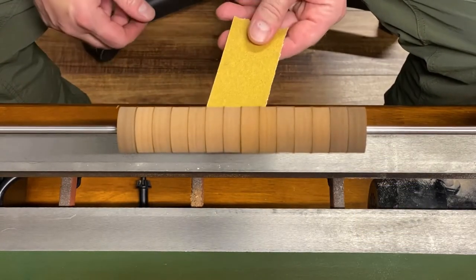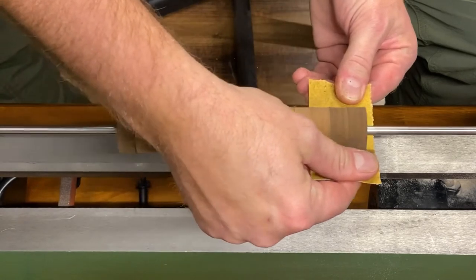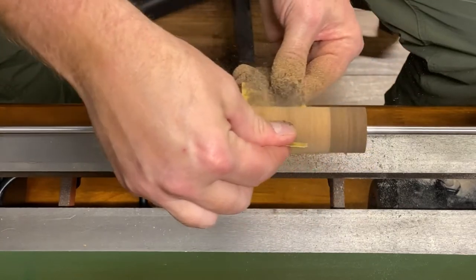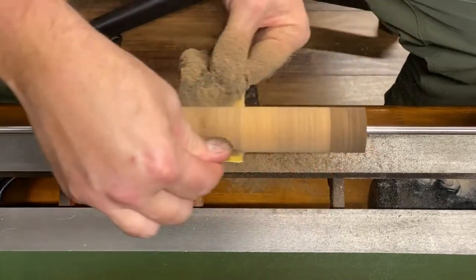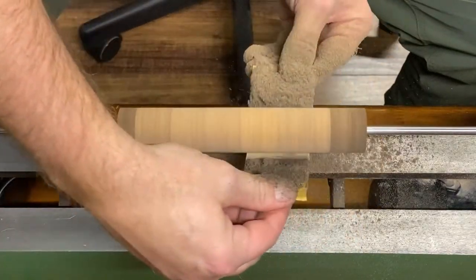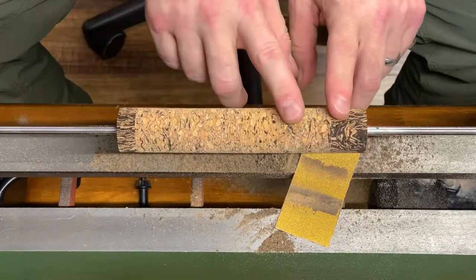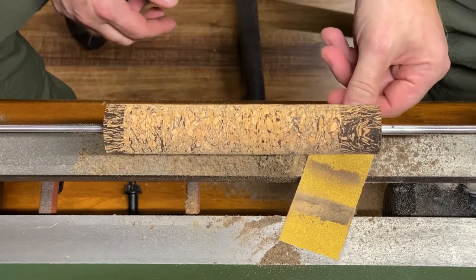I haven't tested this mic so hopefully you can hear me over the lathe. We're going to rough it out with 80 grit sandpaper and do a little bit of shaping. One of the things with turning cork is it gets really dusty, so you want to wear a mask — I am wearing one. After the first initial turning with the 80 grit, that took quite a bit off — it took my glue lines off, so now you can see it's nice and blended. You can't really see the lines too much.